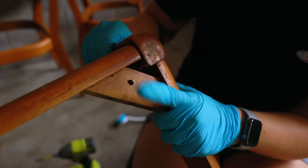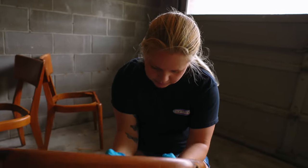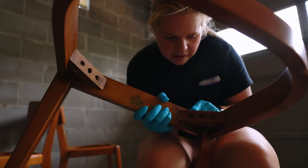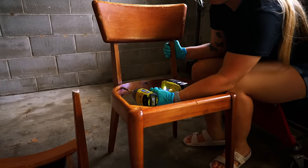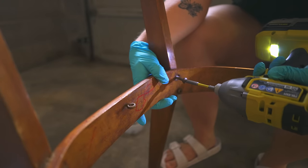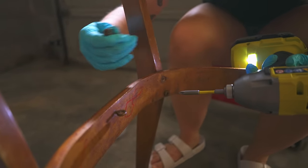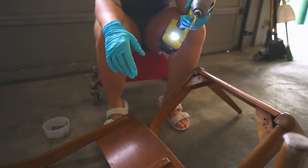They're doweled in — I would have to take these off. I think these are glued in. I'm going to leave this as one piece as well. So each chair will just be broken down to two pieces, and there is a missing screw here to hold this leg tight, so I will need to put a screw in there, but that can be done a little bit later. I'm going to go ahead and dismantle the other three chairs as well.